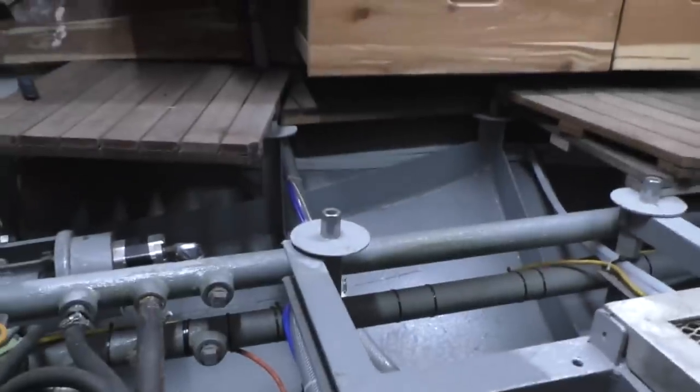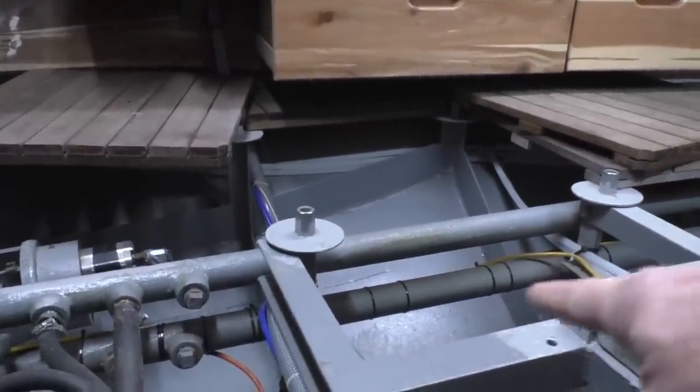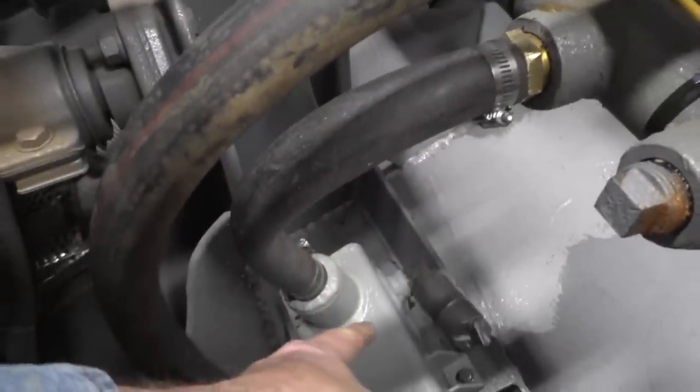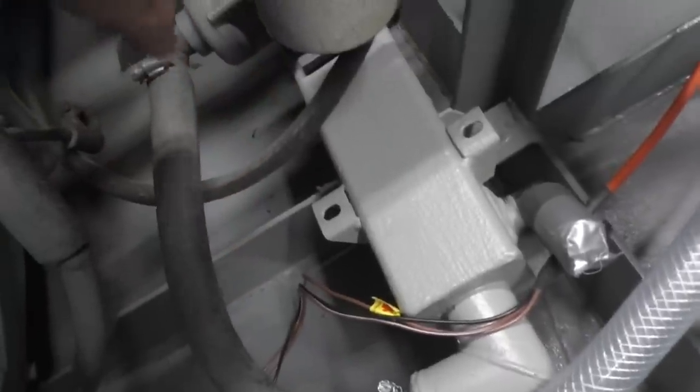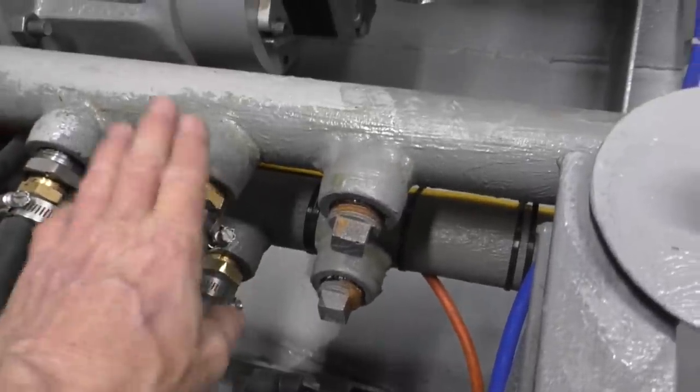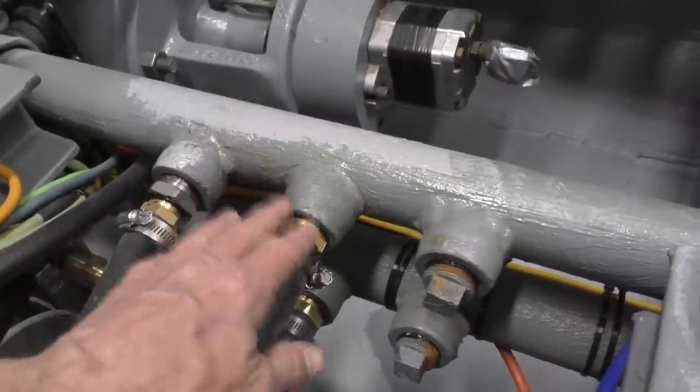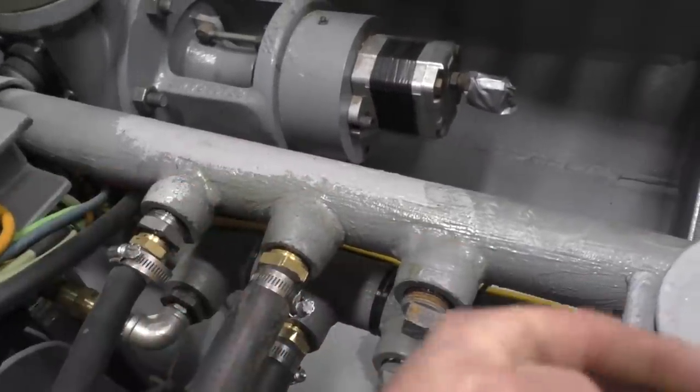Here in the engine room, you can see those two pipes really clearly, one taking hot water to the skeg and the other one bringing cold water back from it. So when we need something cooled, like our oil cooler down here for the transmission that we just finished doing the welds on, that gets its cold water right out of the bottom pipe. That line goes down to this end of the oil cooler, passes through, comes out the other end, goes back around, hits the pump, and then out the pump and back into the hot water out. The engine could be moving hot water through here. The intercooler could be moving hot water through here. Everything dumps this hot water back into this line and onto the rear.